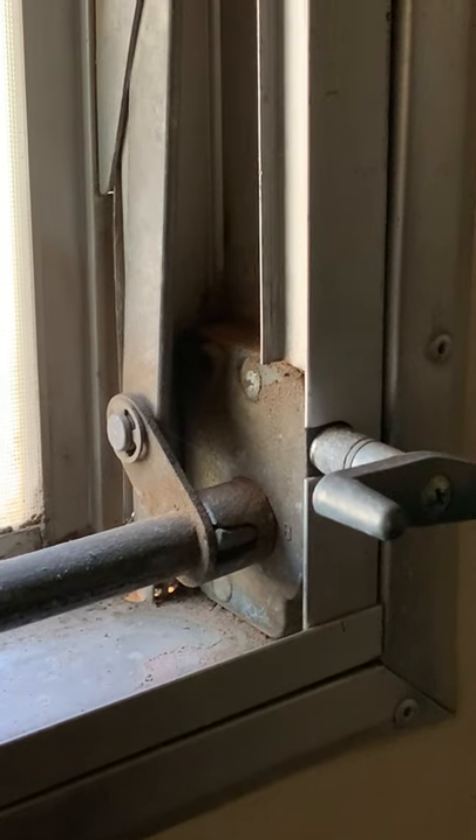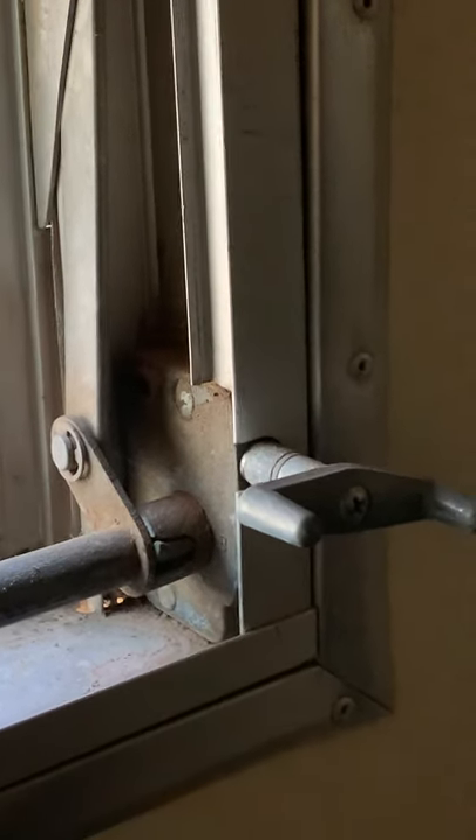There's a louvered window in the back of the bathroom. This is the only louvered window that had a problem — it does work, however you can probably see there is a small crack on the collar that goes around the barrel. That makes it harder to open that window, but there's definitely a way to fix it. They've got assemblies you can buy; you can snap that off and just buy the assembly again, or you could probably fix it fairly easily.